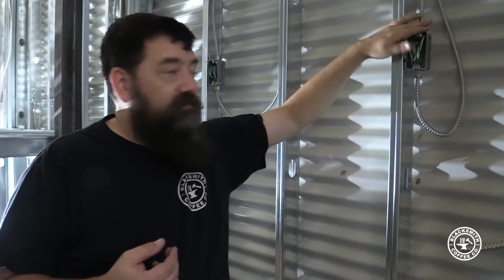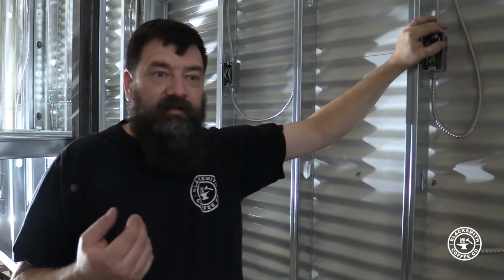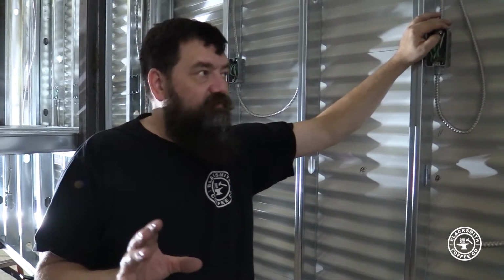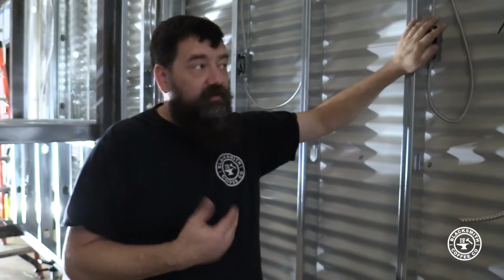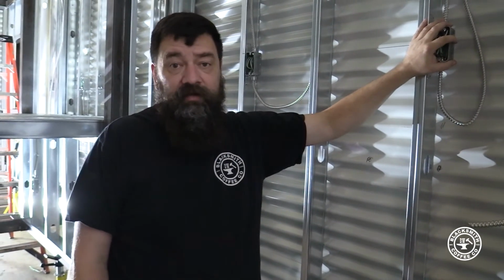The other fire hazard is bad connections. If you connect these wires to an outlet and you have a loose wire, what happens is that wire is going to arc. So a lot of times you've probably seen, like when you plug something in that's turned on, you'll get a spark at the outlet, or you just probably have seen sparks before. That happens when you have something that needs power and then you have power. As those two things get close together, when they almost touch, that power will jump across those 2 points. So if you have a loose connection, that jumping, that arc is happening a lot, and it can actually cause fire. So good connections, making sure they're good and tight, they're solid, having the right sized wire, and then make sure everything is grounded very well. Those would be the biggest tips that I would give anybody that's doing this.